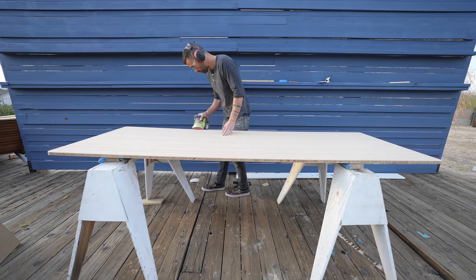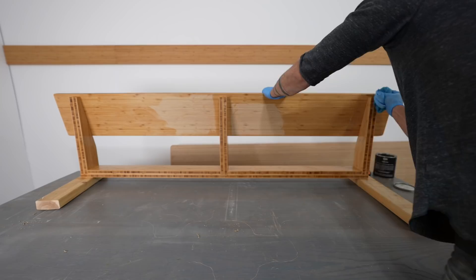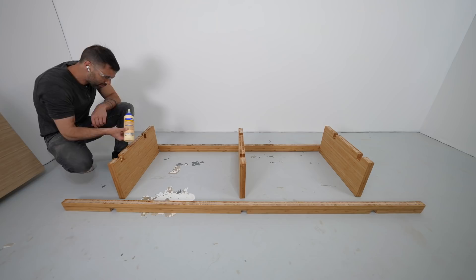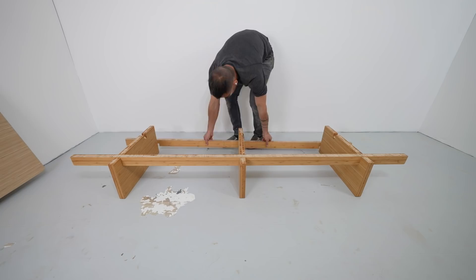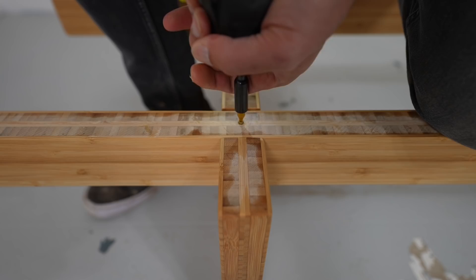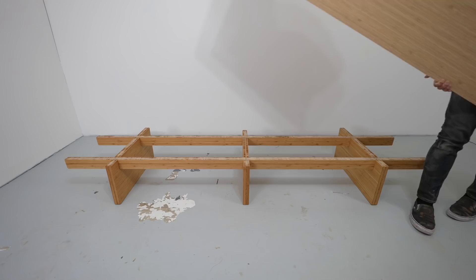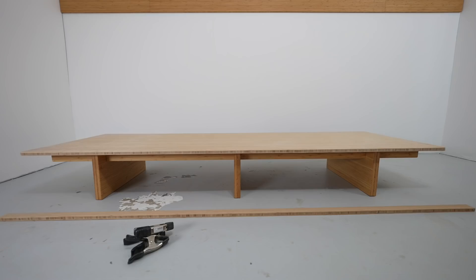I applied some simple finish to the backrest. These days I tend to finish the pieces as I fabricate them — that comes in handy when you're working on big projects and you don't have enough floor space to lay everything out. I applied some glue in the notches that I cut into the legs and then put in the stretchers. I then used some long 3 inch finish screws to screw through the stretcher and into the legs. If you're worried about the wood splitting I recommend pre-drilling some holes, but I lived dangerously and just went for it. If the stretchers were a little bit wider and you used something as precise as a CNC, I do think you could make this knock-down furniture with no glue and screws and just have everything slot together — but maybe we'll try that at a future date.